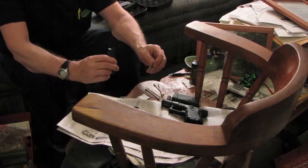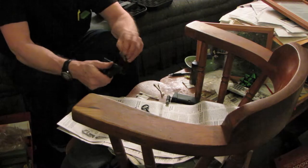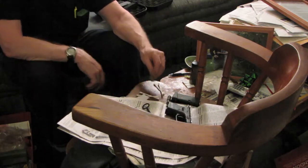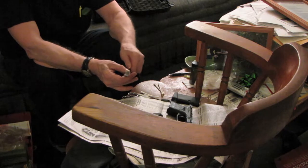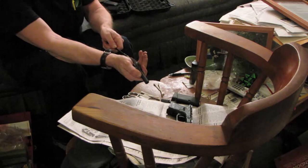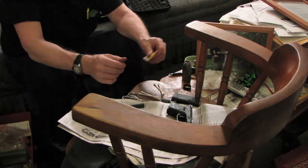Here you can see I've already got it disassembled very quickly, and I'm using a patch with bore solvent to clean out the interior — the body of the gun, the rail, slide, and of course the barrel. I'm cleaning the magazine well, which does get dirty with firing. Now I'm attaching a bore brush, inserting it in the breech end, pushing it out through the muzzle — doing that several times with enough bore solvent applied previously to loosen that burnt powder residue.